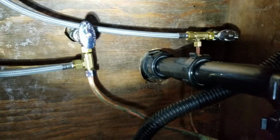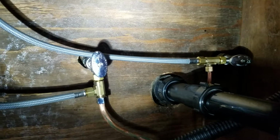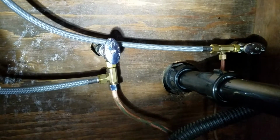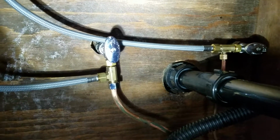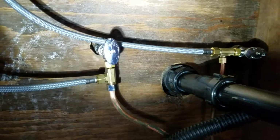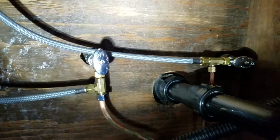So what we've done is pulled back there was iron pipe, there was black pipe, there was nipples in there, things were corroded. We got copper stubbed out of the wall, which is great. So what we did is we took two quarter-turn shutoff valves, compression, one over on the hot side, one on the cold side, and just took all that old stuff out, put new stops on.